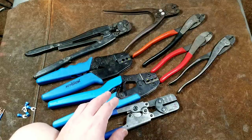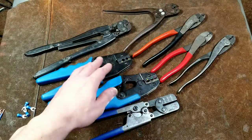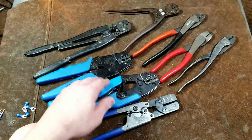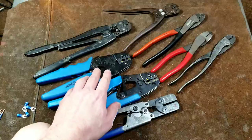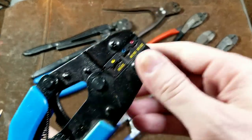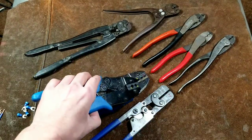Cadis Maximus here with a review and comparison of professional grade wire terminal crimpers — both ratcheting style and forged pliers style. These are the true high quality wire terminal crimpers. If you're doing production assembly work or servicing machines, you may often use ratcheting style to ensure you get a nice high quality crimp. Ratcheting crimpers always ensure a full cycle once started, and they always have a specific die for each wire range. I have two pairs; even though they have different die sets, they're interchangeable.